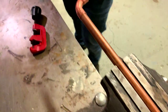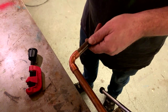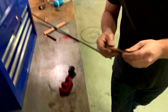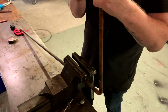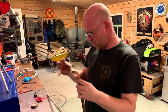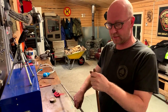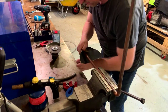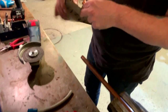So basically, I will put this here. Then I will add a small piece. Maybe I take this piece. And there, I'm going to build on to the shower head. The reducers, yeah, exactly. So I'm gonna cut this other piece off here and then we can tin them all and we'll see what happens. So basically this will go here. This I solder on here. And here I will build that copper shower head on it. So we can shower. This one I nail onto the wall with the clips. And that's basically it, but now every plumber is gonna turn around in his grave when I start soldering here. I don't care. I'm gonna get some sandpaper, hold on. Okay, there's a little bit of clean up here. And I have my elbow here. That's pretty clean. I gotta go in there a little bit.